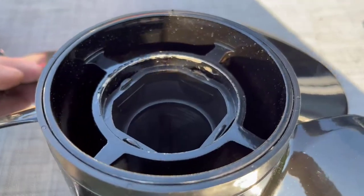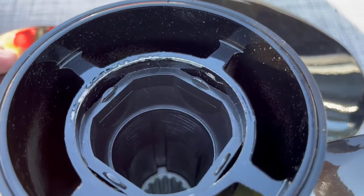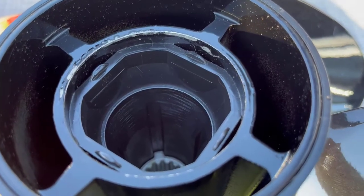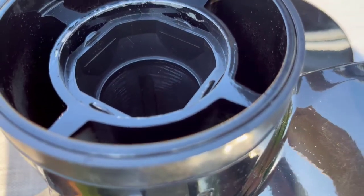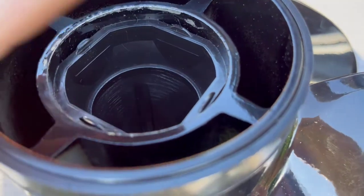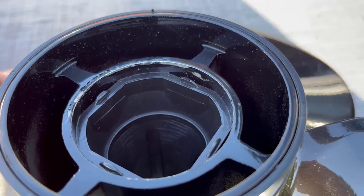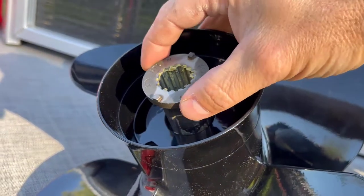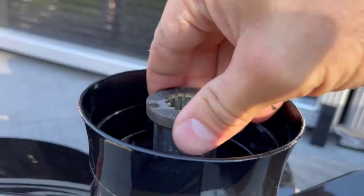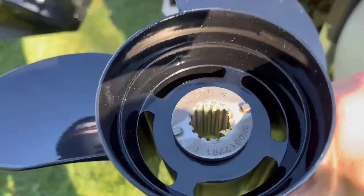One thing I want to mention: with this plastic hub assembly adapter that goes inside, it goes in from the back and just presses down inside. We used a rubber mallet to smack it down. You do want to make sure it's down all the way and seated flush at the bottom. There is a brass backing plate on the engine that you can use after you've got it pushed in — just sit it on top and give it a tap to make sure everything is in there. That's all pushed in and pressed down as far as it will go. So we've got our aftermarket unit ready to go — just press the adapter in and it's ready to install onto the boat.